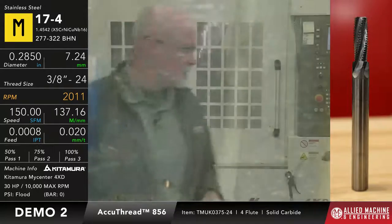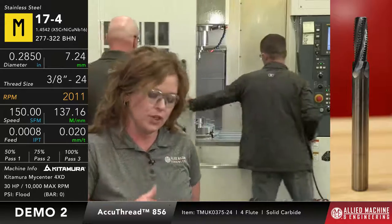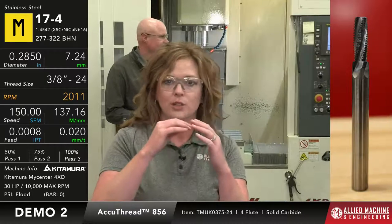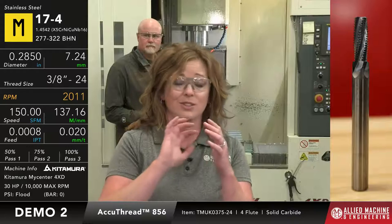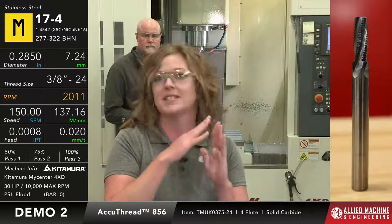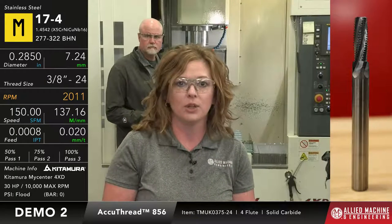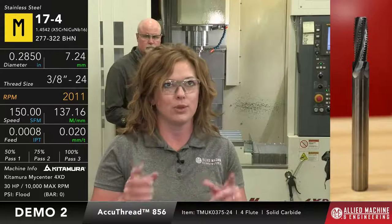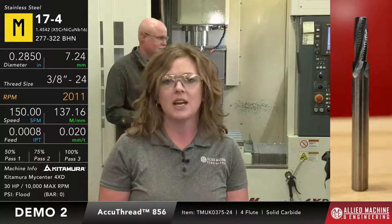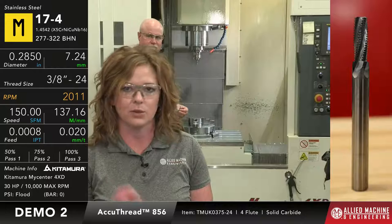Okay? And in this case, you did a 50, a 75, and 100% pass. Yeah. So one thing that I always try to recommend is that you don't want to do anything under 50% pass. Reason is the thread itself is tapered. Therefore, if you get into doing a 25% pass or a 30% pass, you're just scratching the surface. You need to get the threadmill deeper into the groove, the 60 degree angle of the thread pitch, so that it actually can remove some material. So I really don't like to do anything below 50%. The other thing is that tap drill size is also accommodating for taking some of that material away as well. So stay above 50% whenever you're talking about multiple passes. 50, 75, 100% is really nice for three passes.